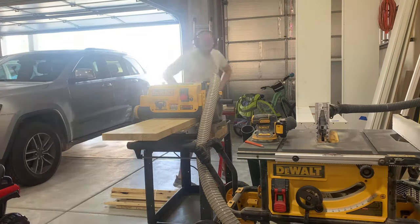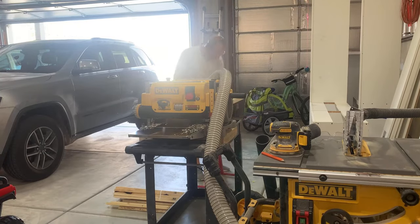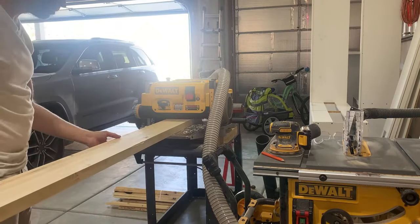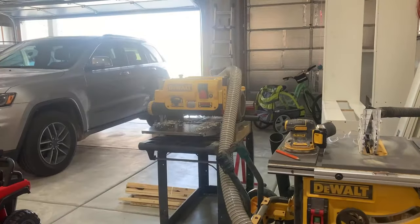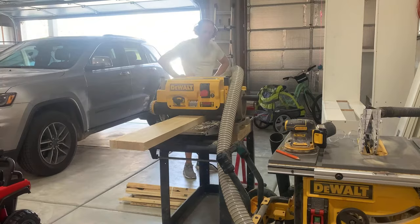If you're curious about this planer, I'm going to be doing a video on that soon. Here's the result of the first piece after the planer — looks pretty good. So I went ahead and started the second piece and did the same process, putting it through the planer and making sure that the glue is completely taken off and any bumps or unevenness on both sides of that board. Just make sure you only plane it down to the same thickness that you did the other piece, because you're going to be gluing these two pieces together to get the correct width for the countertop. If you're curious, please subscribe and look for that planer review in future videos.